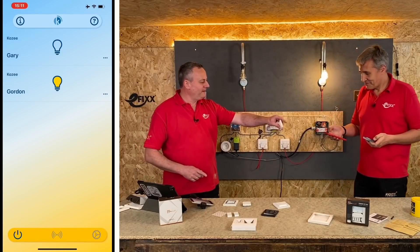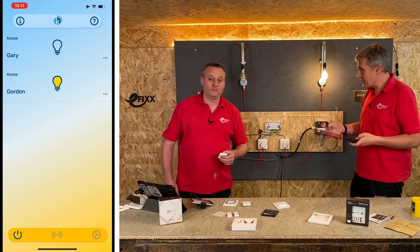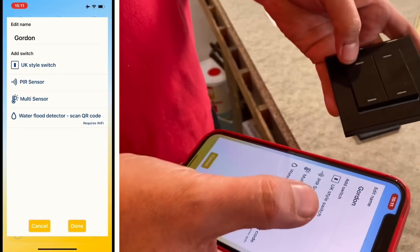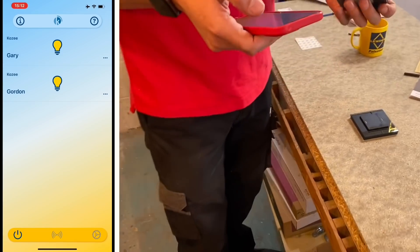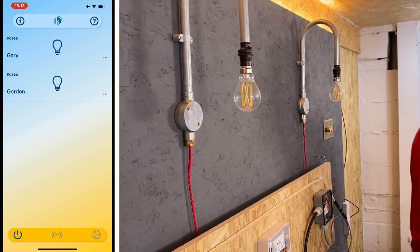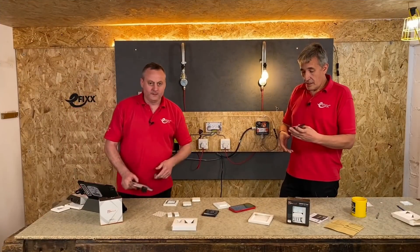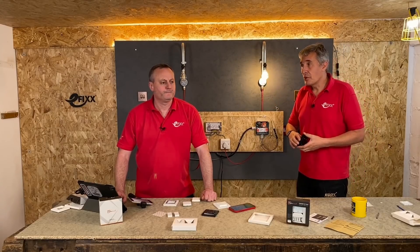So I'm on. You're off. You're back on. I'm off. Obviously my side can't control this and I can't control this at the moment, so I'll just add another switch for that - a two-gang switch. So you're turning both on, not from your mobile device, but you can do it. Dead easy. We're going to start seeing more Bluetooth control in lighting because of the sheer number of devices out there in the world that use Bluetooth - think about connecting phones to cars. And the good thing is it's a global standard as well.